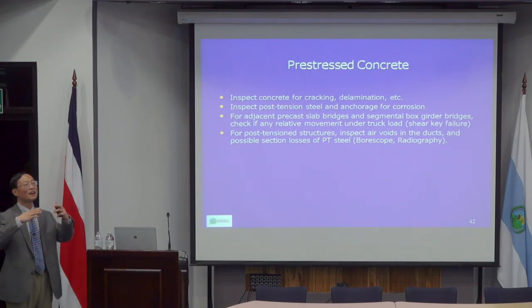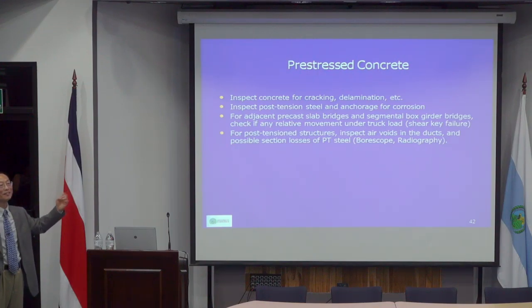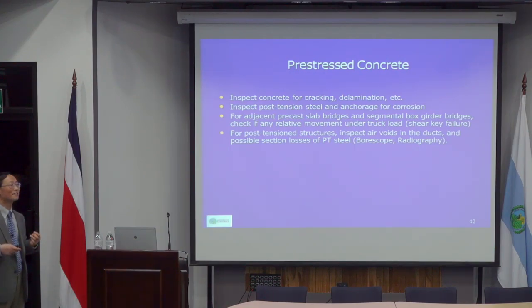Sometimes the concrete may reach the compression limits. That's something you have to verify, especially for very, very shallow structures, as I mentioned just earlier. And so sometimes you may pre-stress your additional member. That is typically done, but in many cases I find after stress analysis or calculations, you find it's not necessary, because it costs a lot of money to pre-stress the member, especially if it's internal. Externally, you can build up brackets and do that.